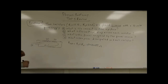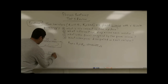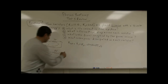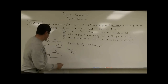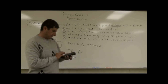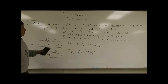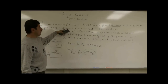If the total resistance of the circuit is 85 ohms, what would be the current? This circuit would act like a 12 volt battery connected to an 85 ohm resistance. The current is voltage divided by total resistance, so it would be 12 divided by 85. That gives us 0.141 amps. That's the answer to part A — the current in the system is 0.141 amps.